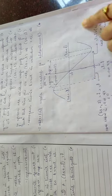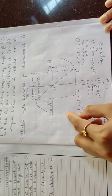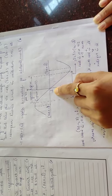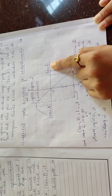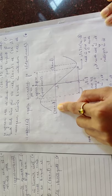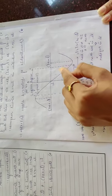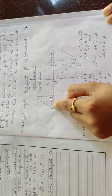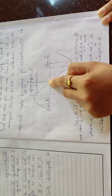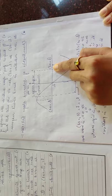The characteristics of the balanced slope detector are also called the S-type slope characteristics. As seen in the curve, f_c is the center frequency, f_c minus Δf is adjusted on the lower side, and f_c plus Δf is adjusted on the upper side. The useful range is where the response is linearly increasing; at f_c plus Δf it begins decreasing. Similarly, with respect to f_c, the response gradually decreases toward f_c minus Δf on the lower side.